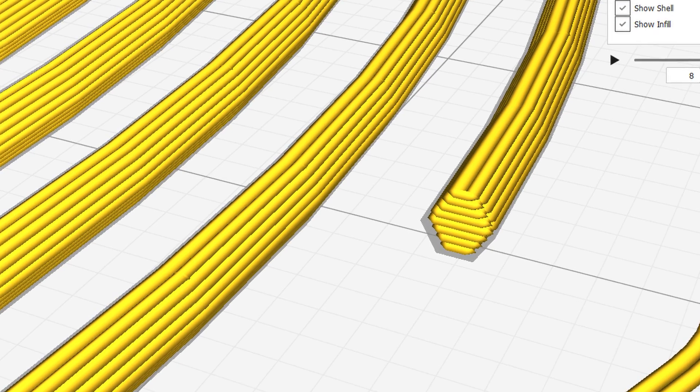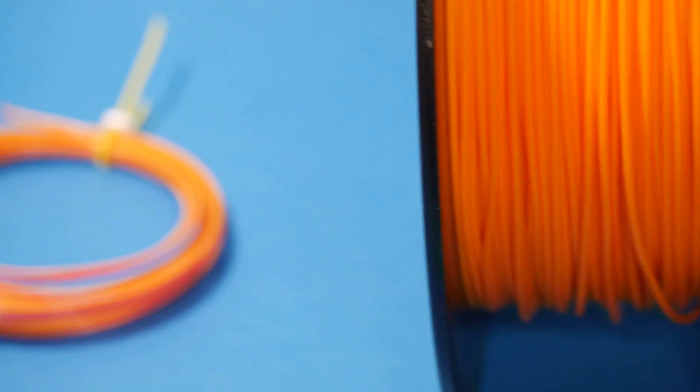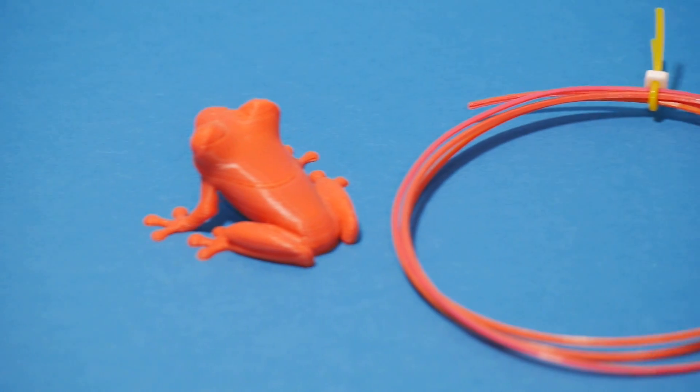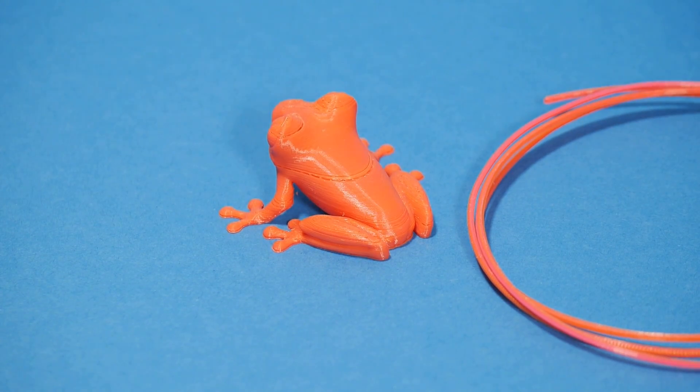Since the 3D printed filament is multiple layers high and multiple lines wide, take your already 3D printed filament with the two colour combinations and reprint the 3D printed filament file with it. You end up with a filament that is a single colour, because it mixes things up quite well. A good example is this tree frog. To get this single colour tree frog, I first printed a 3D printed filament that is orange and purple, then used that to print another roll of filament that is a darker colour. Using that filament, we can finally print this beautiful little tree frog — a colour I like to call Subscribe Button Red.